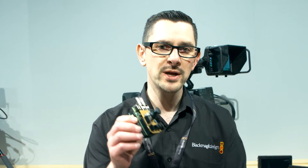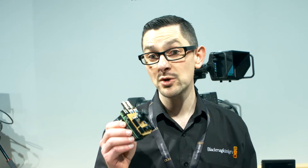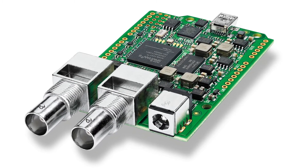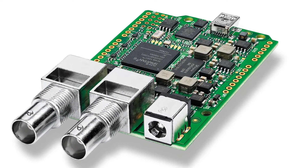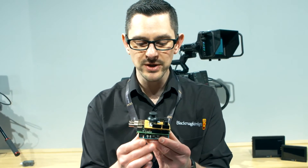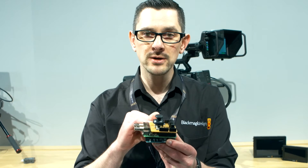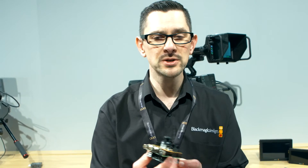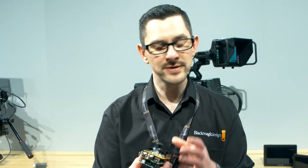But we don't make a CCU for it. So this year at the show we're announcing what we call the Blackmagic Design 3G Arduino shield. This is a shield that sits on top of the standard Arduino board — this is an Arduino Uno — and in the centre of the sandwich is the Blackmagic Design 3G shield. This allows you to, using the control protocols, send communication data embedded over the SDI stream to a Blackmagic device. So if it's a camera, you could send any camera data over the SDI by programming your own software.